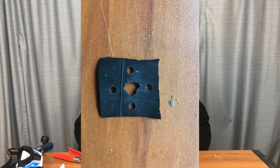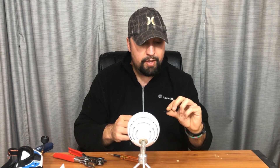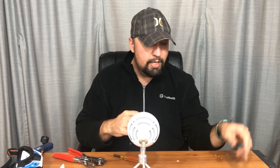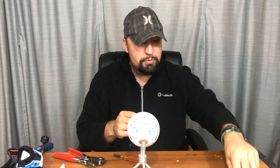You can also leave the outer holes kind of oval-ish since motor stator sizes are increasing so much. Once you do it I don't think you'll have to redo it constantly — pretty much any time I replace or change out motors I change these mounts too because they look horrible. It does add a little artsy craftsy build time, but once you get in your groove you can knock a lot of them out. They're a little easier to mount because the rubber is slightly sticky so it doesn't slide around — get one screw started by hand, then get the next in with a screwdriver.